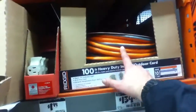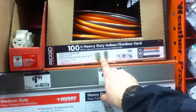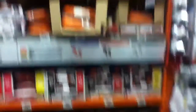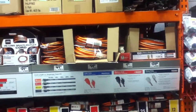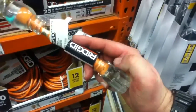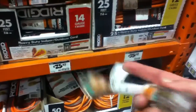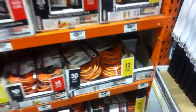When we look at a heavy-duty outdoor generator cord, that's 10 gauge cable rated for heavier-duty stuff. One thing that gets a little weird is some of these have little LED lights set up with a voltage indicator that may or may not work when you're running DC through that cable. But this is where you get a lot of good ready-made cables with waterproof connectors, which are far superior to cigarette lighter plugs. As long as you use your three-element cord sensibly — ideally without the little light — you can't put them together upside down unless a tab is broken off, so it maintains polarity.